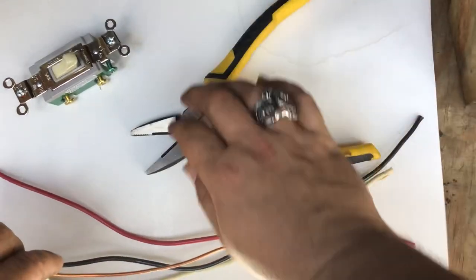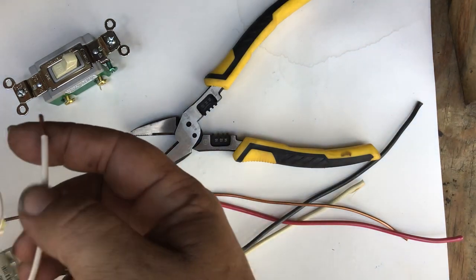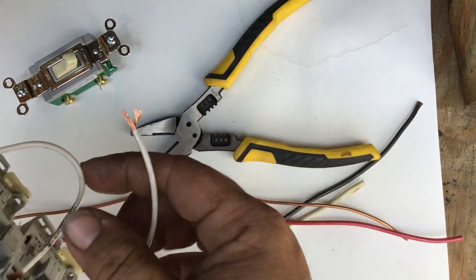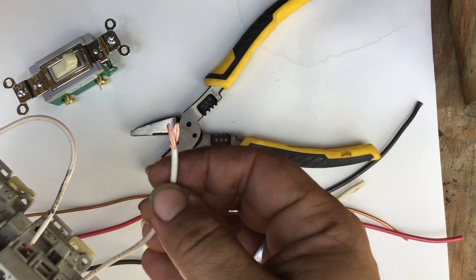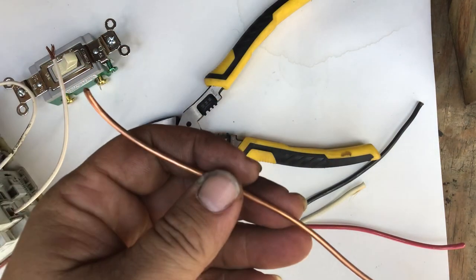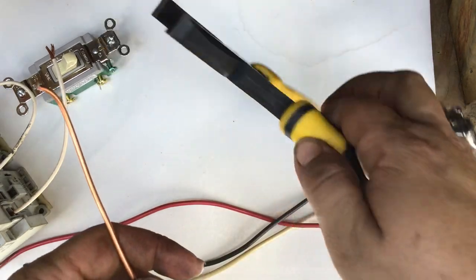For those who don't know the differences: AWG — American Wire Gauge — basically refers to the thickness of the wire; the different sizes you'll deal with. This here is what they call stranded wire — it's wire you'll find in your average everyday electric appliances, like your vacuum cleaner cord, light cord, TV cord, DVD player cord. It's also the kind you'll find inside vehicles if you work on cars. The solid wire it's talking about is solid copper wire, which you find inside your house — in your receptacles, light fixtures, and breaker box. This product strips both.